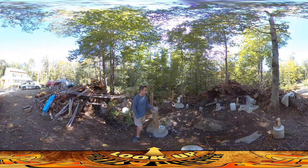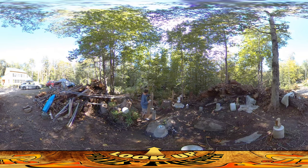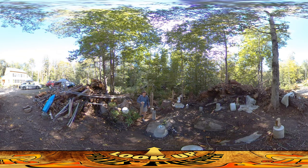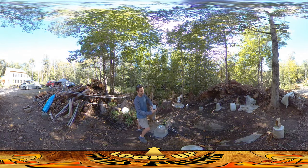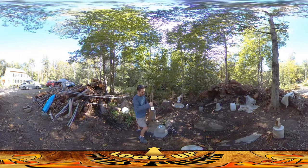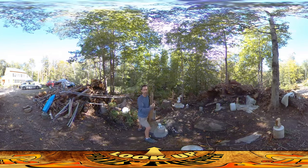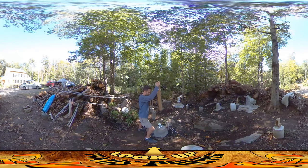So I'm glad I just finished all the concrete work. What I'm working on right now is putting in these posts. You can see over here there's one of them — they come up, and they've got these two little notches on the side. These two notches are going to take two pieces of pressure-treated 2x6 that are going to run along the whole length of this thing. I'm drilling out the middle — I already drilled it out — using these little brackets as a guide to center it and drill a hole for the bolt that's sticking through. I'm checking the bolts to make sure they're straight; my intent was straight up and down, but sometimes they settle a little bit, so when I drilled the hole I accommodated for that.